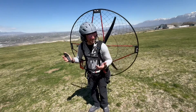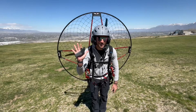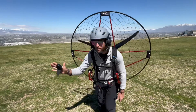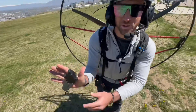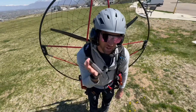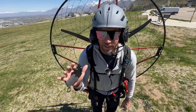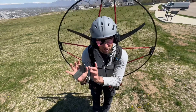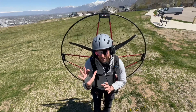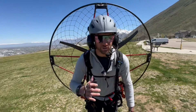That's all there is to it — and of course zero noise when I'm not hitting the throttle. It also has cruise control, so as you're flying you can use this trigger to set the cruise control so you don't have to have your hand on the throttle all the time. For instance, when flying the Moustache wing with the motor and my hands on the brake toggles with the T-bars, I like to use the cruise control so I can set it to whatever percentage I want and not constantly hold the throttle.